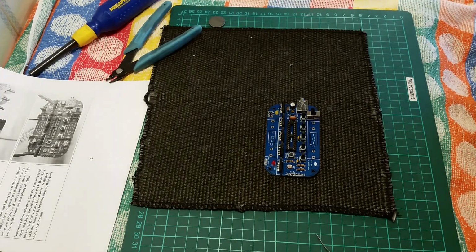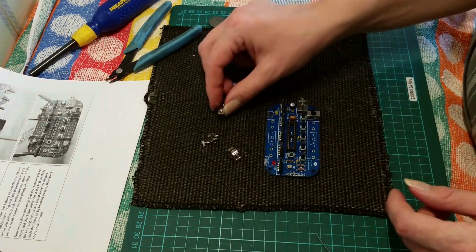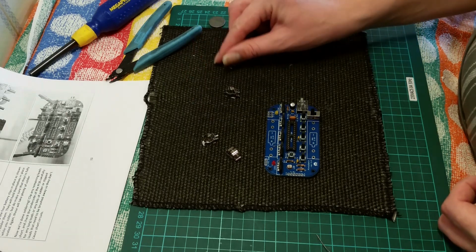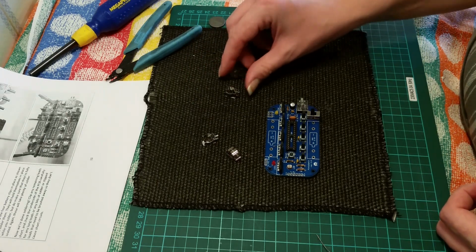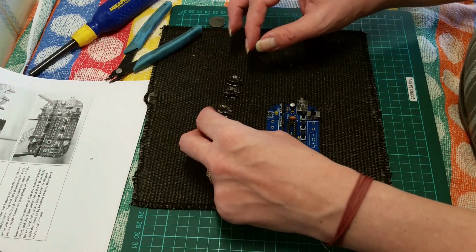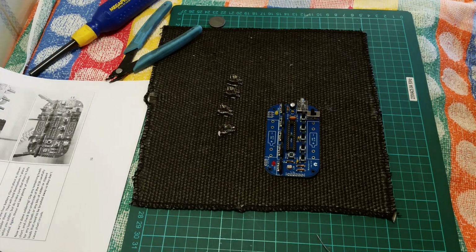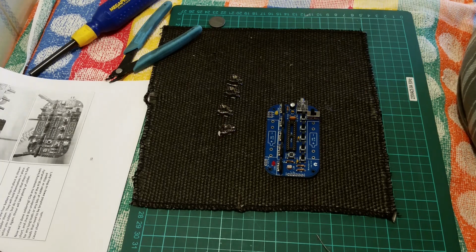And now we're on to the battery holders. Now, are these all identical? They seem to be. This project takes AAA batteries, so they all seem to be identical. The instructions say, finally snap 4 battery clips in place as shown and solder them. They will hold themselves in place while you solder, but do make sure that they're fully seated. Again, these will take plenty of solder. Now we are done soldering, clip any remaining leads.